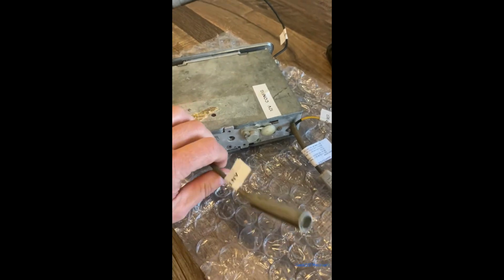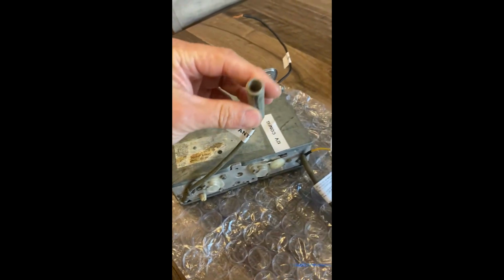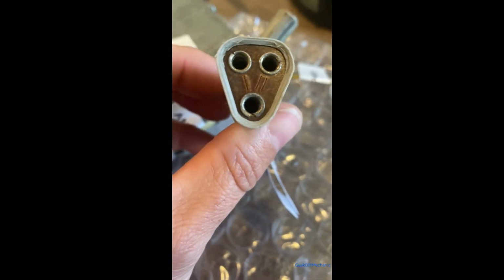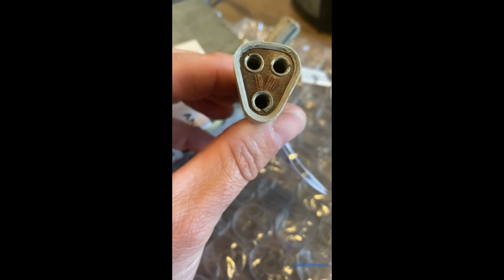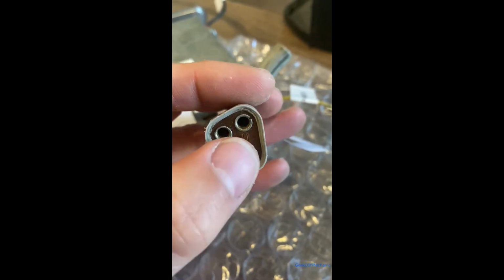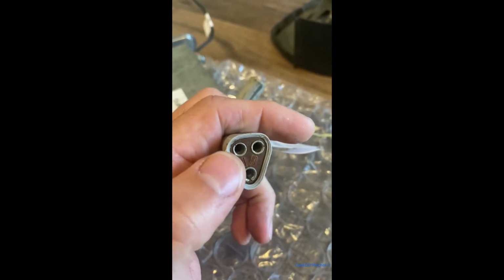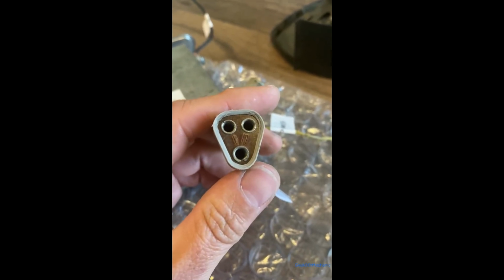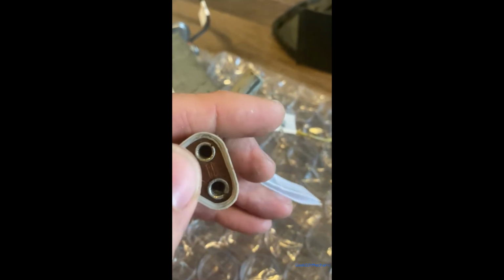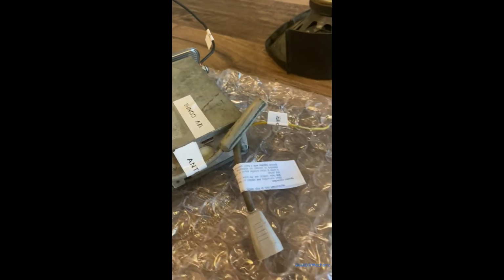The next topic is the antenna. This is the antenna wire, classic antenna. Speaker connection. If you notice on the right, it has 2 lines, and on the left, it's a single line. So this will probably be the positive and negative, positive and negative. But what's the difference between the single line and double line? On the left side, the single line, you put 1 speaker only. On the right, you can install 2 speakers in parallel. The documentation will show it, and I'll show it right here.